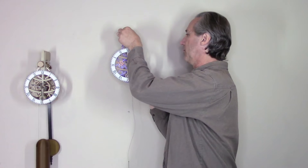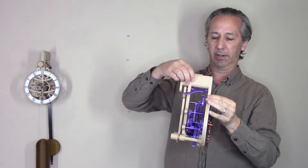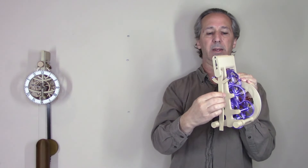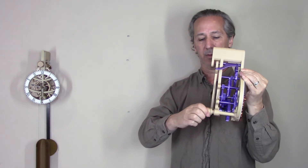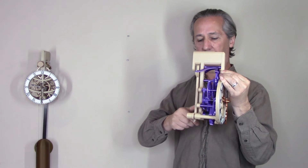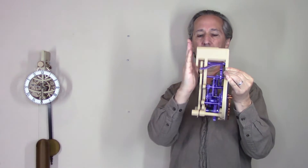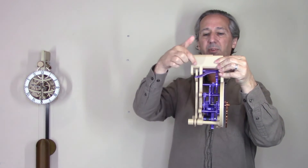There are a lot of other features copied from my other clocks. There's a solid connection between the pallet and the pendulum arms, so when the pendulum swings the pallet moves with no slippage. There are also adjustable standoffs on the back of the clock that allow the frame to hang reliably against a wall even if the wall is uneven — you can adjust for that, which really prevents frame sag.